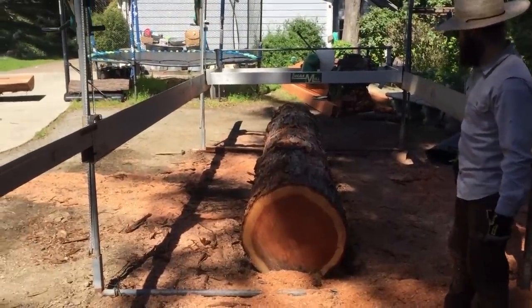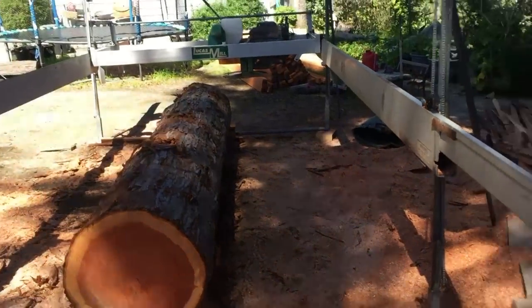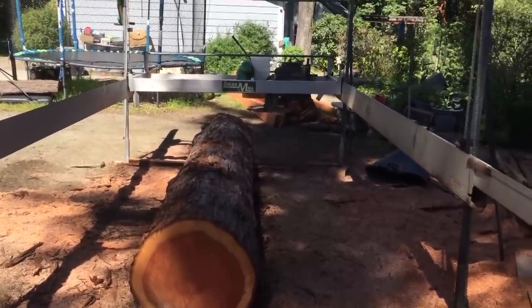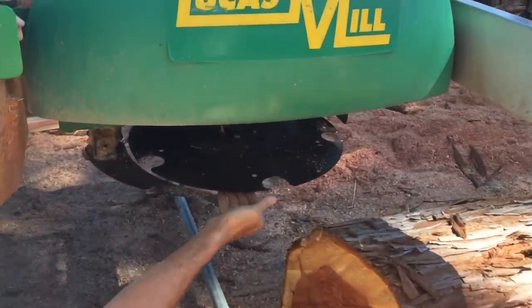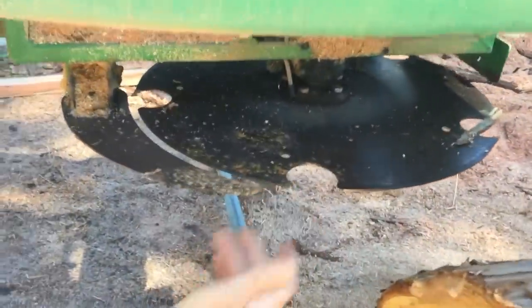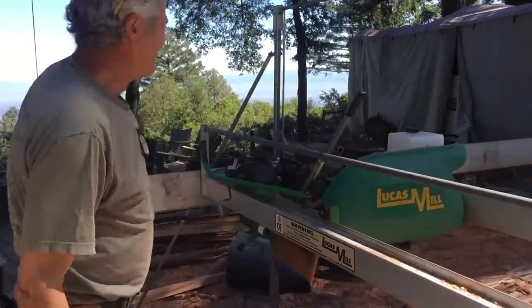The side-to-side isn't as important — it's the parallel from this rail to this rail. I've got two extensions on. I don't need any more, but I can make this thing up to 24 feet long. The maximum mill length I've done is just about 22-foot logs, but it's real tight turning the blade — comfortable is 20 feet. Always check the teeth, make sure you're not missing any — there's only five of them. Still reasonably sharp. It's got a sharpening jig I can put on there as well. Kyle jokes: "Don't overdo it on the video — you do these really long drawn-out videos. When it comes to editing, you'll give me five minutes and I'll take ten seconds of it."